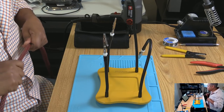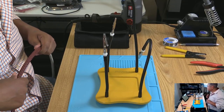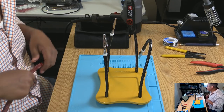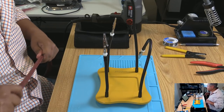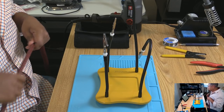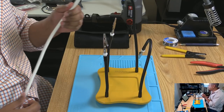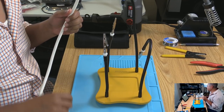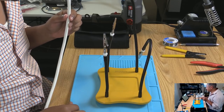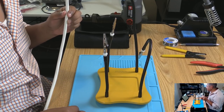So while we're on the subject of cons, I'm going to digress to dispel a few sort of pseudoscience-y bull. So scientific testing has shown that basically run-of-the-mill oxygen-free copper cable, of the same make and gauge, performs just as well as those ultra premium snake oily cables that you can get out there. So what do I mean by that? When comparing a straight cable like this, no twists, no braiding, actually this has slight twists, but when comparing a straight cable of the same length, the same gauge, same type, meaning oxygen free copper, not a copper clad aluminum.